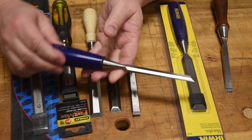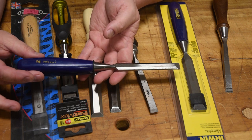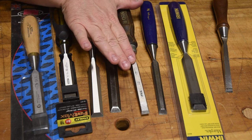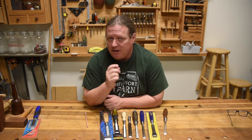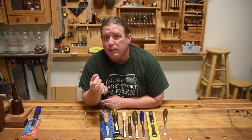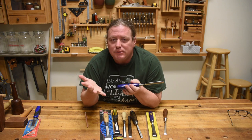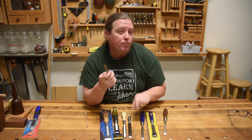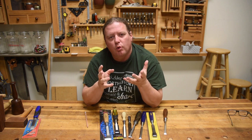I used this tool for 10 years without realizing I was missing out on anything. I only found out the advantages of other tools for my specific purposes when I bought a bunch of different ones and tried them out. I ended up choosing this tool for my school because I loved the steel for my application — something in constant use, easy for students to resharpen, meaning it was probably a little bit softer. But if you're using a tool occasionally, on a job site, working in rain or humidity with sweaty hands or gloves, that would be a poor choice because it's thinner and wouldn't take as much abuse.